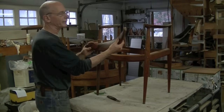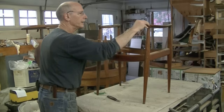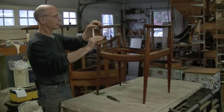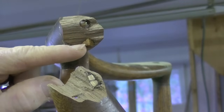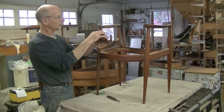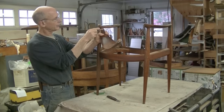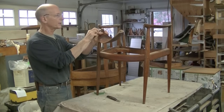This came off easily when I took the tape off. On this side it came apart right at the joint, but the dowel is broken, so I can replace that dowel and glue that back. This side's more difficult — it's broken right in the short grain area of this back rail. I've noticed that it broke at the end of the dowels; the dowels themselves aren't broken. It broke outside those dowels, so I can possibly re-drill those dowels much longer across that break.